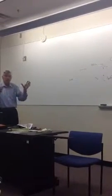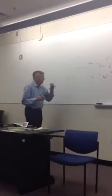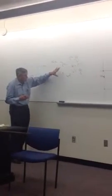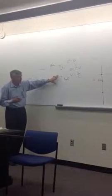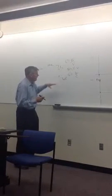So the current can change instantaneously, but the electrons aren't moving instantaneously. Okay, so at this point, we do have current. So we're dumping charge on here at a rate of 10 milliamps, which would be 10 millicoulombs per second coming on here. So the voltage is going up at that rate.